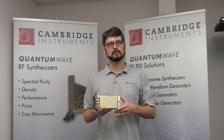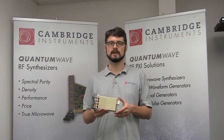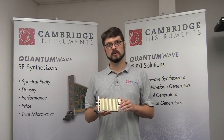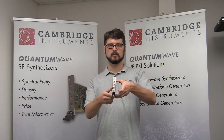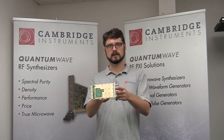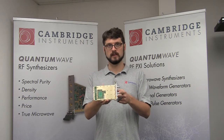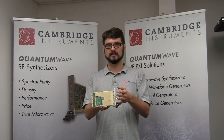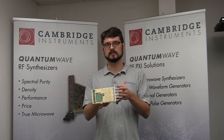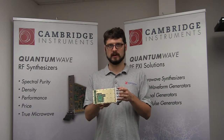We developed this instrument for use by the quantum computing research community in collaboration with the IARPA MUSIC program for ion traps. The 4083 is an RF synthesizer occupying a single PXI slot with three independently controlled RF outputs. It features exceptional spectral purity and low phase noise. The top and bottom channels provide CW signals tunable between 25 MHz to 6 GHz with 3 Hz resolution and variable output power.